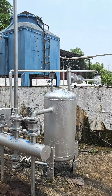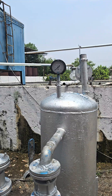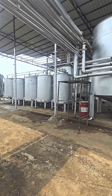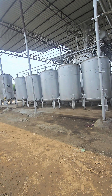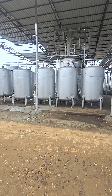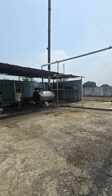This is a vacuum system. It is showing 750 mmHg. When we do a distillation of biodiesel or any higher fraction product, we have to do distillation under vacuum. Without vacuum, it is not advisable to do distillation. For such a heavier product, we compulsorily have to do under-vacuum distillation.